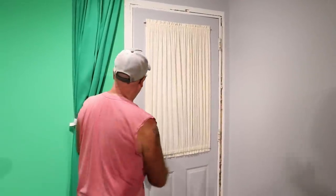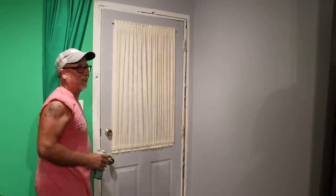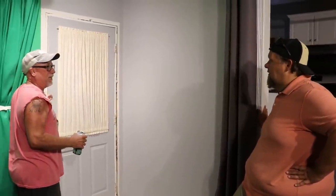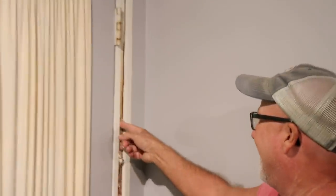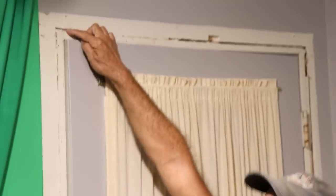If you shift it this way, I cut in here into the wallboard. I put this door in back when I was like 26 or 27 - wet behind the ears. This is against the frame - you can't put it against the frame, there's got to be a space. I've got this big giant space over here and I put plywood there. This whole door should be over here. The two by four is right on the end up top, which is why this whole thing is out of whack. I also put a board underneath it when I installed it, so it's a big job.